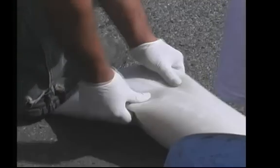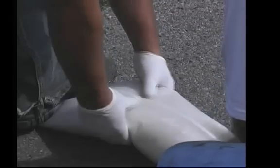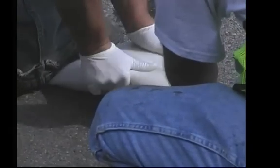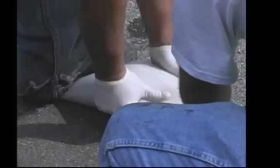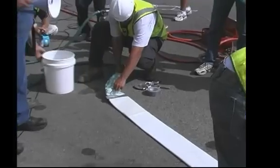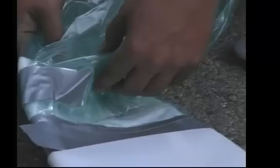How do you get this spread out against the wall? You'll see it's got an air bladder. It's a bladder and the liner is inside the bladder. What you're looking at — you just brought up a great question — was how do you keep it blown up once you get it in there? They're wetting this out and you notice the resin isn't coming out on the street here. That's an air bladder on the outside. When this inverts, the air bladder will be on the inside, actually holding the liner up against the wall with a predetermined amount of pressure.